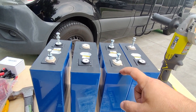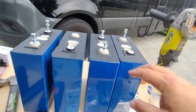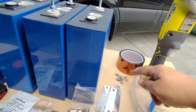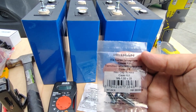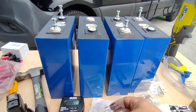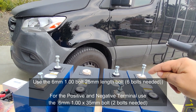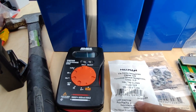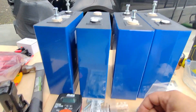These e-cells right here can be purchased for about $450 to $500 and I'll have links down below on where you can purchase those. Be very careful when ordering — only use recommended vendors. When you buy these cells they come with the bus bars and some very inappropriate hardware. You're going to have to ditch the screws in this kit and instead get some longer bolts — the M6-1.00 — and you want the 25mm for the studs. For the two places where the BMS connects, the negative and positive, get the 35 or 30mm to have that extra room for all the connectors.